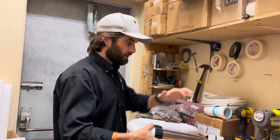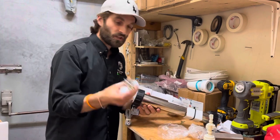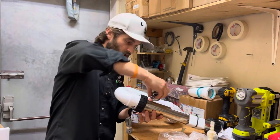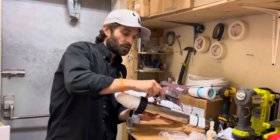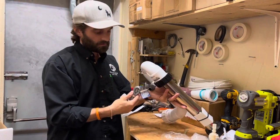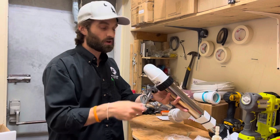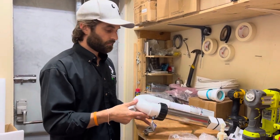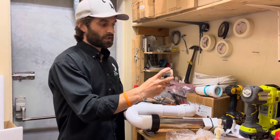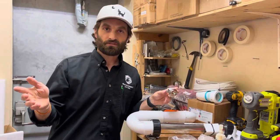So you've got your parts, you've cut the wire, you've closed the knife valves. Take a flathead screwdriver and remove the cap. You can put a tiny bit of Teflon tape on the threads of the pressure switch, then screw it into the heater tube. Connect the wire harness — either using the old wire you've spliced to fit the pressure switch, or the new wire purchased with the pressure switch. Pop it in and make sure it's nice and snug, and make sure the plug is plugged into the right spot on the circuit board.